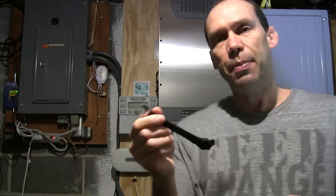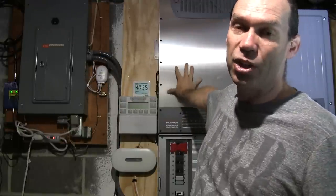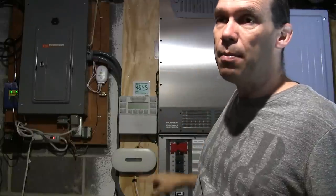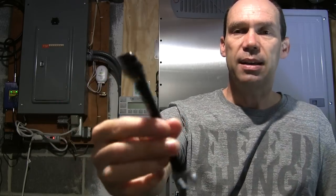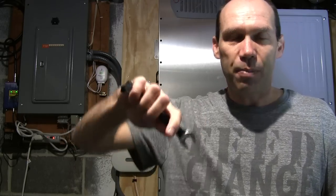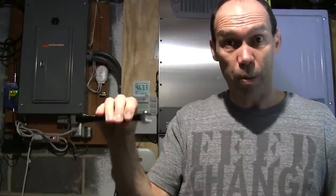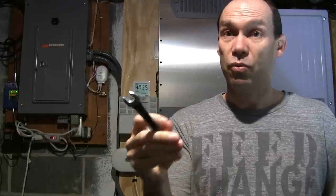I'll show you the battery cabinet below. Working on a system like this: even if I switch off the main switch, the battery bank is going to maintain energy, which is why you have to make sure you de-energize all the bits and pieces that could keep this live. For working on the battery bank, I've wrapped my number 13 spanner with insulation tape — that's the one I need to undo the connections. Battery boxes are generally made of metal. If you're on a 48-volt system with a lot of energy and your spanner touches the casing — which could be earthed — while sitting on the positive terminal of the battery, you're going to have a high release of energy.